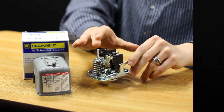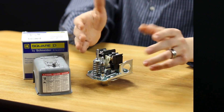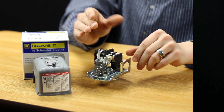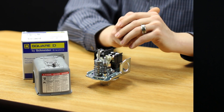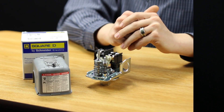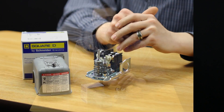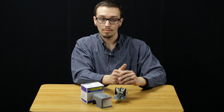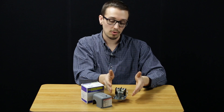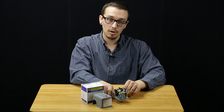The more important and more common thing to adjust is going to be the overall pressure setting of the switch, and that's adjusted by this larger spring here. By tightening it roughly a quarter of a turn, you're going to increase the overall pressure by about two to three PSI. If you need to run your pressure a little bit higher — for instance, if the home is up on a hill and you need to compensate — or if you want to run lower pressure, you would either loosen or tighten according to what you're trying to accomplish.